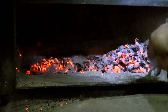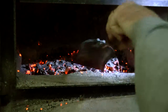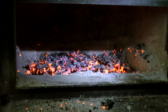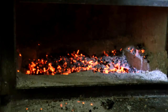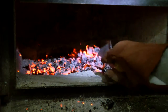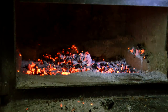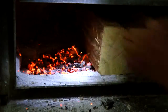Now what you want to do is move these ashes in the middle and across, and try to rake some of the hot ones to the top. The best burn configuration to get a wood stove started after you've had to drop all the ashes out is a half-moon short piece of wood that's split, so you've got two wedge-shaped pieces face to face. Peak these up in the middle so you're off the bottom a little bit, get that air under the wood, and get a good burn.